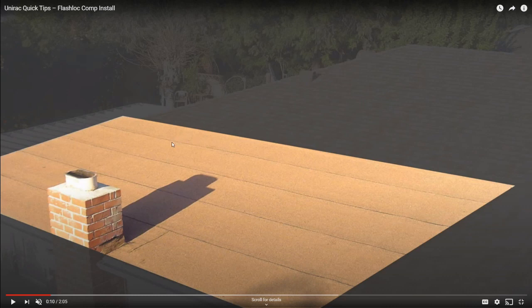So if you have the cheapest of shingles, you might not be able to pry them up off the roof without destroying the shingling system. You have to be smart especially on a retrofit older roof, because the roof might look good to you, but you might find when you actually get up on it that the shingles are just old enough that if you start abusing them with that pry bar, where you're sticking the pry bar underneath the shingles to pry up the roofing nails, the shingles just start falling apart.